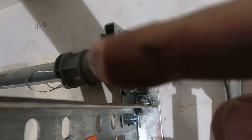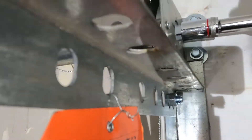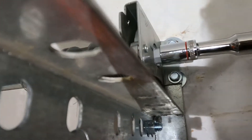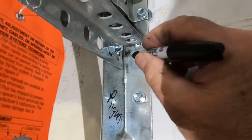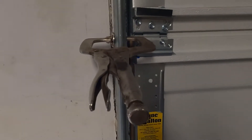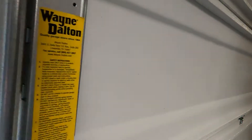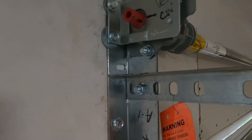Starting from the mark: one turn, two turns on the right side as instructed. I'll go ahead and mark those. You'll notice I've got locking pliers on here to keep the door from climbing up — same at the other end. Now this left end is clockwise, so we're going to go clockwise.